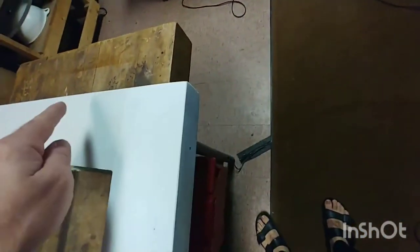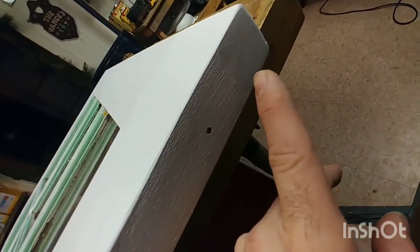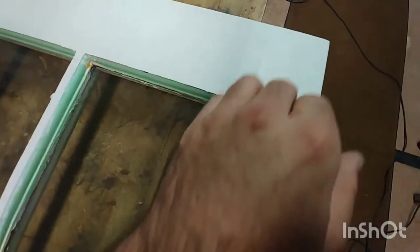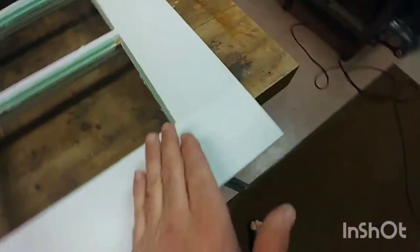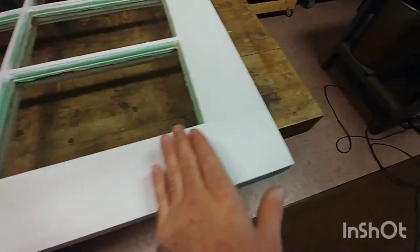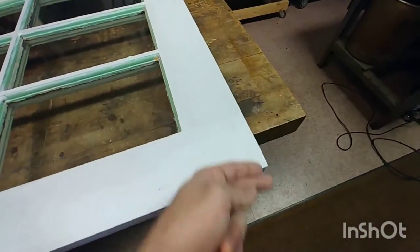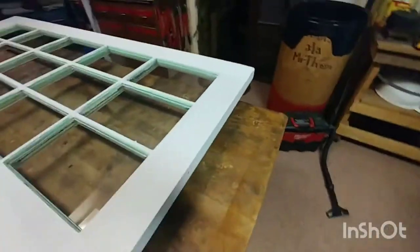And I added this piece to the top, like I said, when I started that spiel. You can see from the end grains here that it's different. But I brushed through. Now, the grain is raised on here because the primer is soaking in. I'll probably sand that, and I'll brush. Not only did I brush the primer through to disguise the fact that the grain goes that direction in that spot, I'll brush the paint through in this orientation as well.